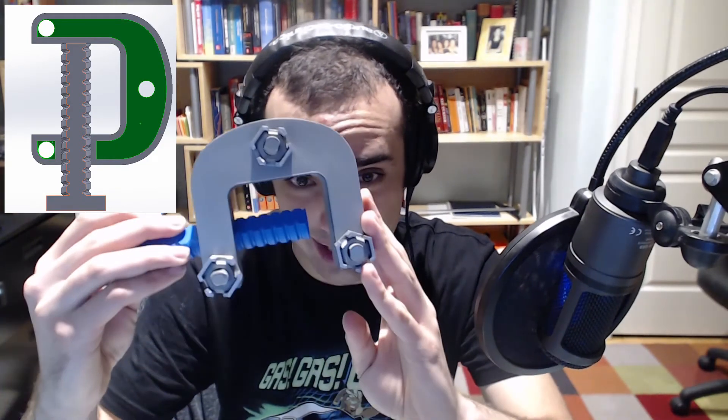So here it is. It's a lot stronger than I thought it was going to be, and I had pretty high expectations. It's held together by three of these fasteners right here. The most interesting thing about this design is that because there's a seam along the middle, all of the force when you pull down is converted into a wedging force that mostly tries to split this ring apart with hoop stress. The weakest link is trying to separate these two halves, and all of the force is absorbed in the tension of this nut and bolt right here, which is what it's designed to take up. So this is a lot stronger — I can crank on this thing a lot more than I thought I was going to be able to.